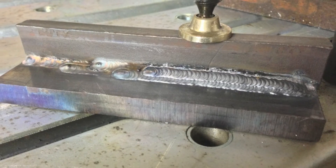Then finally, for the third pass, we use the upper edge of that second weld and fill in between that weld and the vertical plate, making sure that we fill in both sides and keep it full — always on the constant lookout for undercut along that upper edge. We want to keep a close eye on that top edge, because that's something the inspector will pick on you for quickly if you have a lot of undercut. So make sure you keep that full and don't have any undercut, and you'll keep the inspector out of your hair.